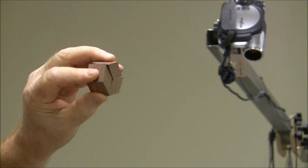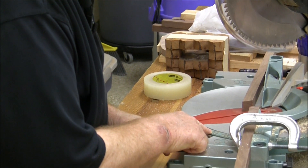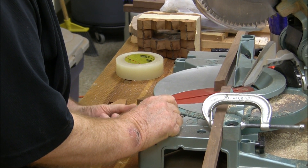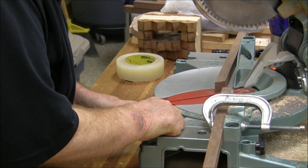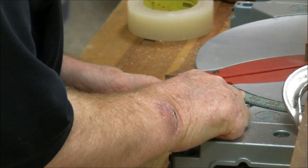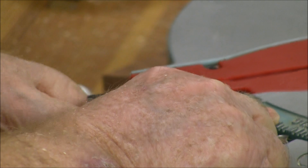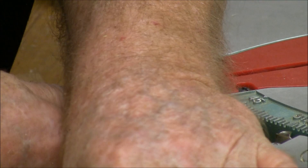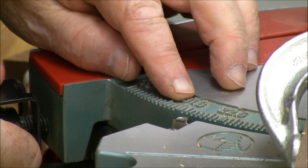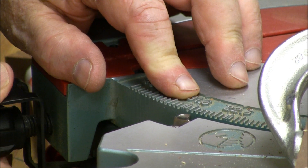I'm not at 30 degrees. I used the Vernier on here — that's 31.6. And 22 and a half. It's hard to determine what 30 degrees is on this particular saw. But I think it's that mark right there. It slips when I try to tighten it up on exactly 30 degrees — it's supposed to fall into detent at 31.6. Bear with me a minute, I'll make it work.